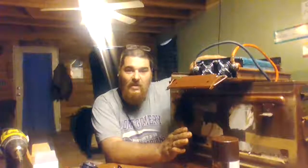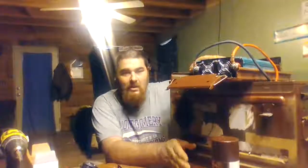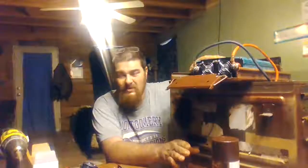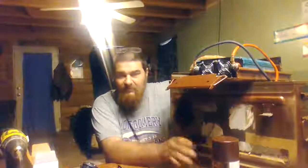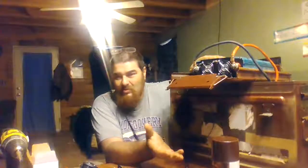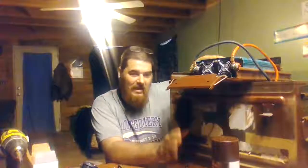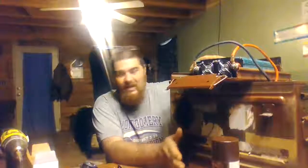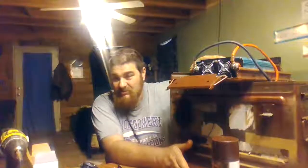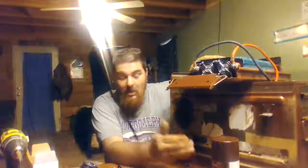I got a 1500 watt Jax inverter. It's a pure sine wave inverter. It works really well. I ran a refrigerator on this system for 2.5 hours straight, and it didn't really pull the batteries down. So I'm figuring I probably can get 6 to 8 hours running a full-size side-by-side refrigerator that never shuts off. I'll be replacing it soon.